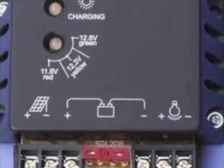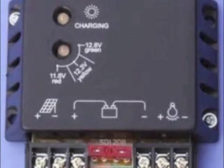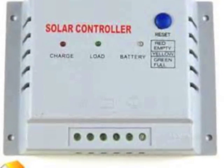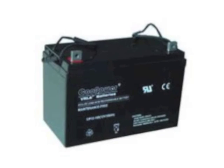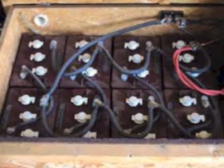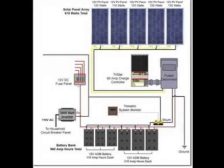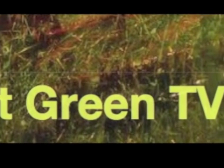Power cords from the panels come through a roof vent and are also connected to a solar charge controller that puts power into batteries — this is the work in progress. An important alternative use for your solar panels these days is for standby power systems. These controllers help make that happen, but you will need special deep-cycle batteries. They are expensive, need maintenance, and will need to be replaced — and you need a lot of them. Here's a diagram of a solar system with batteries; it's very complicated and will be the subject of future videos on this channel.